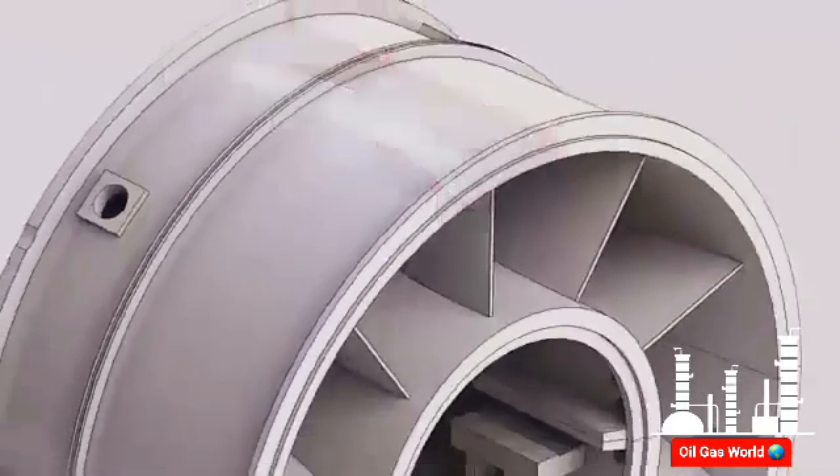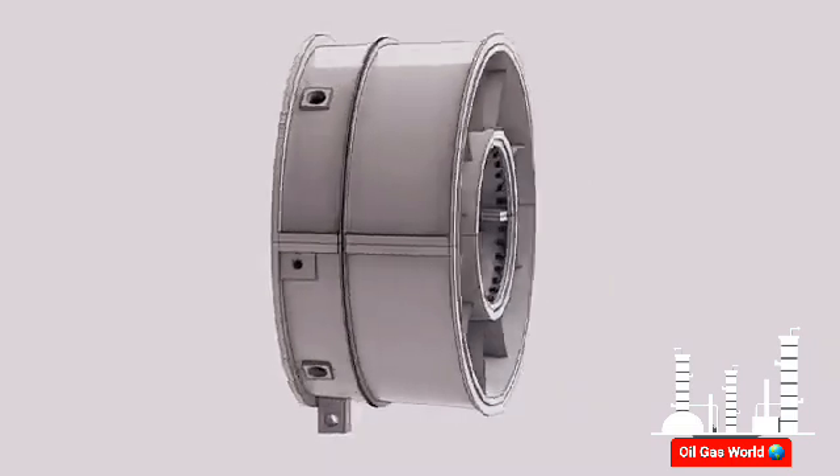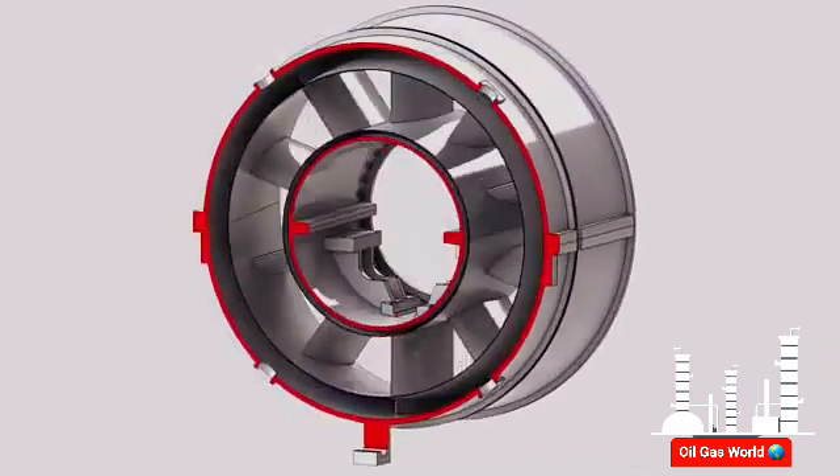The struts are covered by airfoil-shaped fairing surfaces. The inner and outer diffuser and the airfoil-shaped fairing surfaces are metal surfaces which protect the exhaust frame parts from being exposed to the high temperatures of exhaust gases, in order to maintain temperature stability. This stability is required to keep the exhaust frame inner cylinder, which carries bearing number three, in the accurate position, avoiding any misalignment. To ensure temperature stability, air is forced by means of two off-base blowers between the exhaust frame outer cylinder and the exhaust frame diffuser surface through four ports.